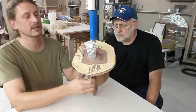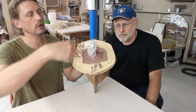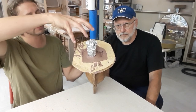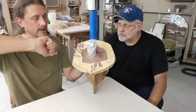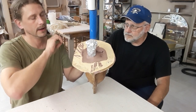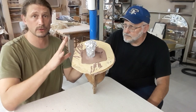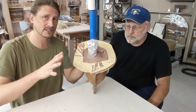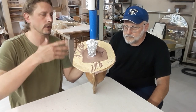What we had to do first was go through and add in all the clay — put the monster clay into this mold and basically create a new casting so that we could edit it and make sure it's really appropriate for doing a plaster cast, because there are a lot of differences between doing slip casting and doing a normal casting.